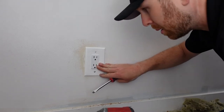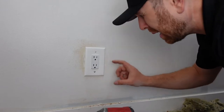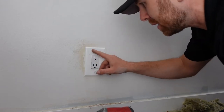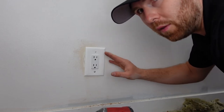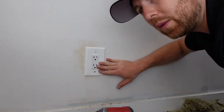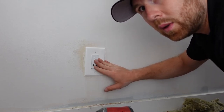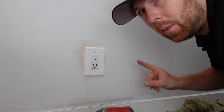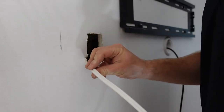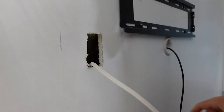The bottom outlet is finally done — I've jumpered the three conductors into the existing outlet. My particular situation was a little complicated because the junction box wasn't properly affixed to the stud, but you probably won't have that problem. The base plate is back on, and the wiring being jumpered up now connects to this outlet. Let's move on to the top one. This is the cable that jumpers into the bottom outlet, so now I'm going to finish this side off by trimming it seven inches back.